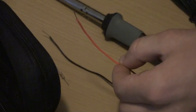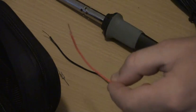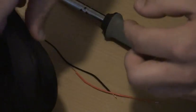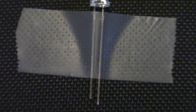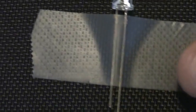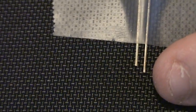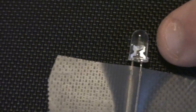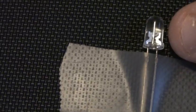So we've got our positive wire here. Before you start soldering up your LED and resistors, you need to know which side of the LED is positive and which is negative. If you look closely, the negative side of the LED leg is shorter than the other. The shorter side is the negative lead and the longer side is the positive lead. You can also tell inside the LED — the negative lead is also fatter than the positive.